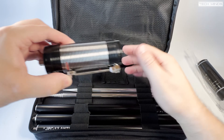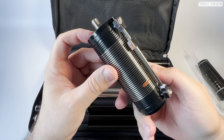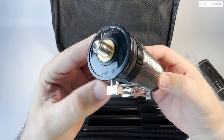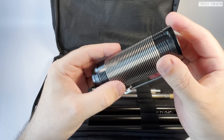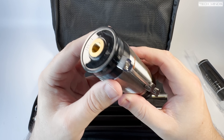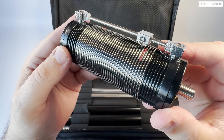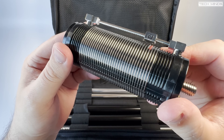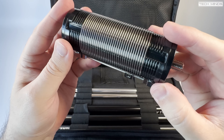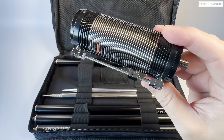The last component is what the manual calls a multi-band inductive coil, made from nylon in a mold. To tune the antenna you simply move the slider up or down the coil — it clicks as you move it and stays firmly in place once set. The manual provides brief information about how long the telescopic antenna should be, or whether to use the coil or the lower extension poles, depending on which band you want to use.